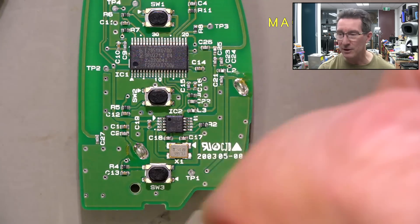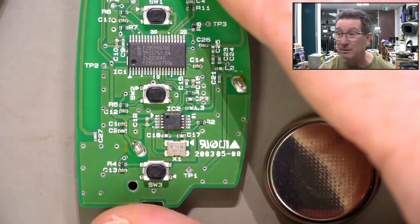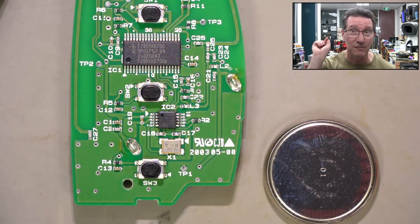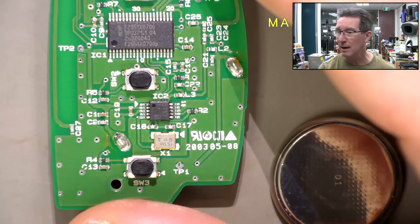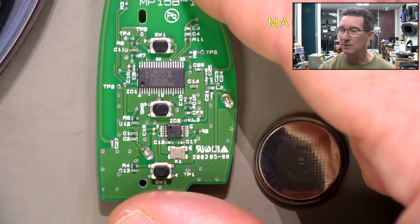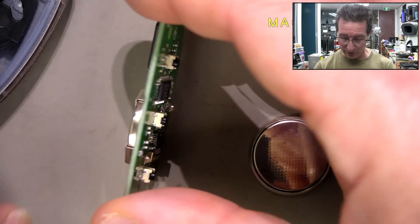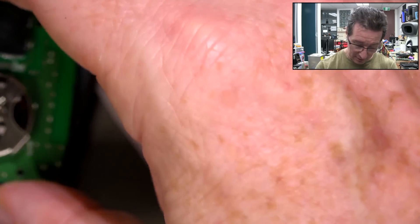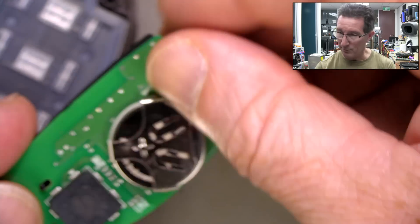So that's doing all the RF goodness. I presume it's periodically listening for the signal and then pings back that yes, I'm inside the car. Or it sits there receiving, waiting for the ping from the car - the car sends the ping and then this thing transmits back. Because you don't want to transmit when you don't have to, because that's where most of your power is taken up - in the transmit. So yeah, that's what's inside a Hyundai IONIQ key fob.